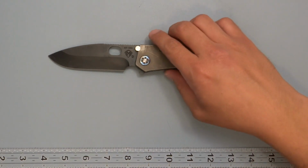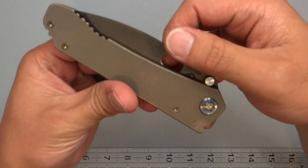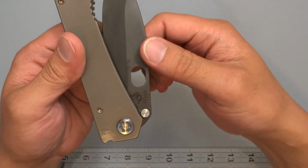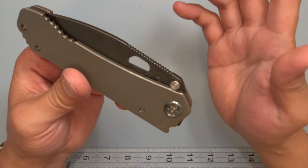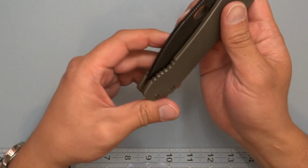This one, for the live pull gauge for the detent, came out to 1 pound 13.8 ounces. That's to get this to open up. Basically I put in the alignment pull gauge and do a pull on it, and to open the blade is 1 pound 13.8, which is still really good. Normally for myself it's about 2 to 3 pounds. Something with a thumb stud, I'm good with that. No weight for it, because that's where it can be a little bit less.